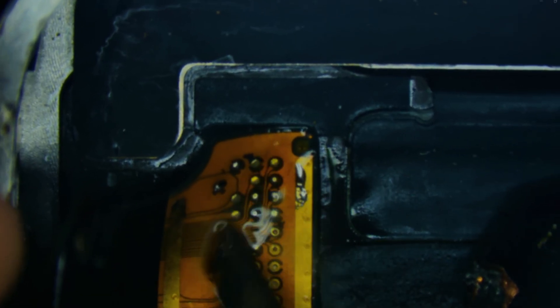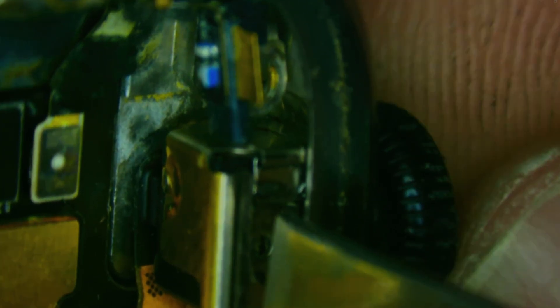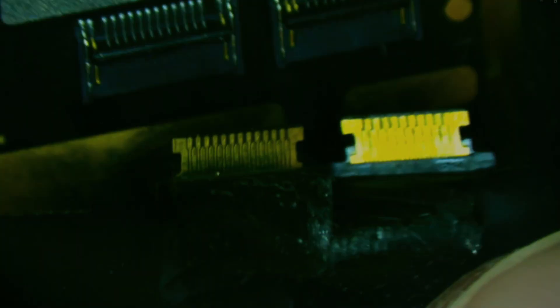The actual connector itself is damaged as well — I could make a completely separate video on how to replace it, as well as the power button and crown, as they are both quite difficult to replace. But with the right tools, replacing the crown and power button isn't crazy difficult. Now it's time to slide in the flex cable with the new connectors installed. After pushing them in and clicking down the latches, reconnect the battery, put back the battery bracket and the little micro screw, then push the power button and look for that Apple logo — and there it is.